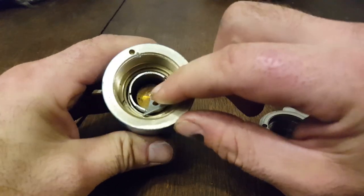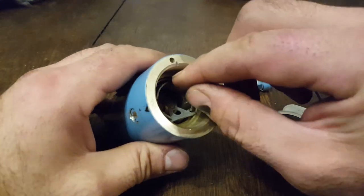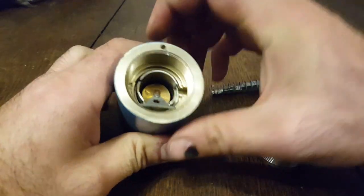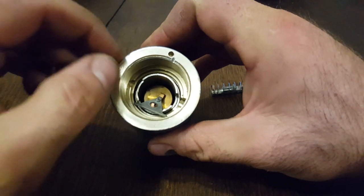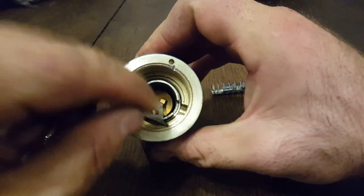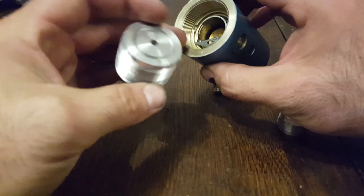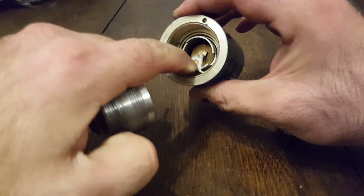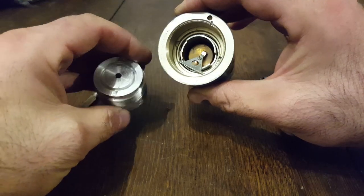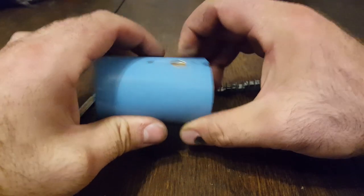At this point, if you found one and it was like this, dropping it would cause it to explode. As it goes, you're going to get an impact. You can see the big piece of brass in there — that's going to act to push the firing pin forward. This whole thing moves forward with the weight, which pushes this up here into the ring on the back, which will cause this to move forward and set off the rest of the explosive train to set off the rocket.